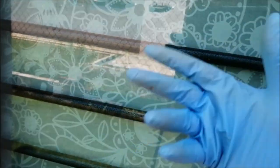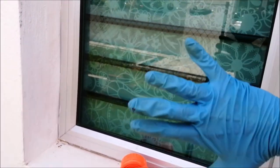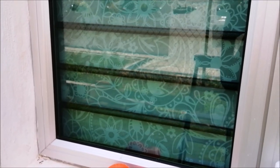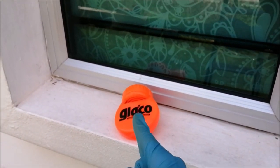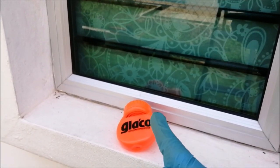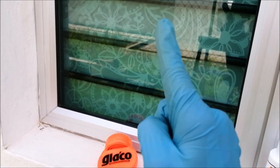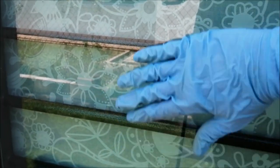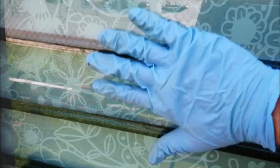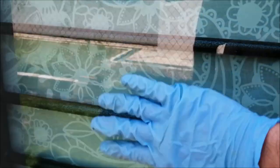Yes, you might have some dust and so on, but with a rinse of high pressure water, you will remove all that without any scrubbing or cleaning of the window panes. That is the advantage of using this. You may use it on any windows or your car window panel, your windscreen and so forth, anywhere. But you must make sure the surface of the windows is clean from any dirt or watermark. The surface preparation must be very, very clean. It's very important to have very good surface preparation.